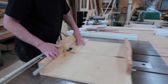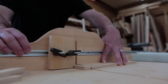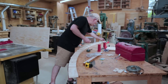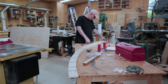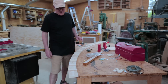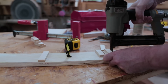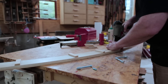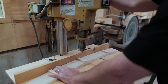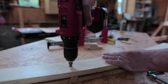It wasn't as easy as just slapping some horizontal wheels on, because I needed a track for those wheels to run on — I hadn't made the bottom part of the beam to do that. This was a design change midway through the build, so I had to make a track that would hang underneath the lower part of the beam. From what I could tell, that track had to sit a little lower than just connected to the lower part of the beam, so I made some little spacers so it would sit down from the lower part, letting the wheel clear the structure, support flanges, and everything else up there.